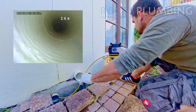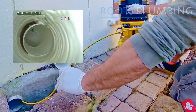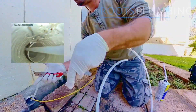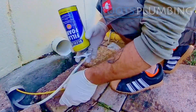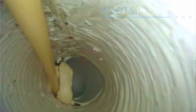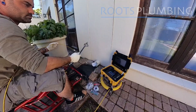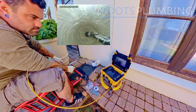The pipe's coming down and it looks like the pipe is a bit smaller than the fitting, or the fitting was squished, so the water's coming through and probably flowing out a little bit there. To seal the large gap at the bottom of this down pipe, I need to pump some foam into the large gap, let it expand and dry, and then once it's dry I can cut the excess out and do a smooth coating on the surface. Then do a final coat on top of the filled gap.